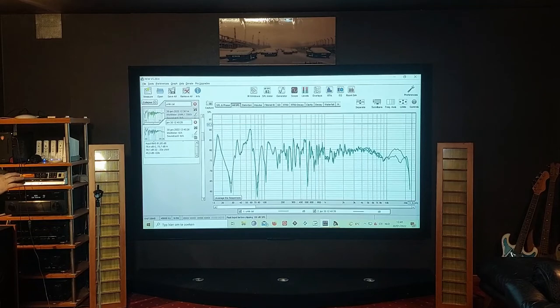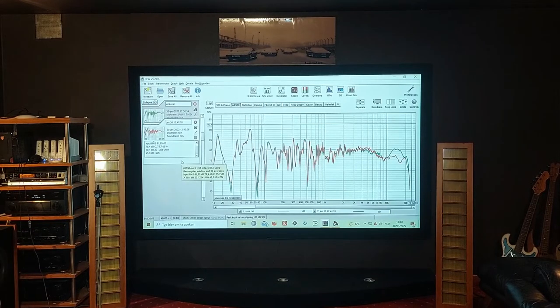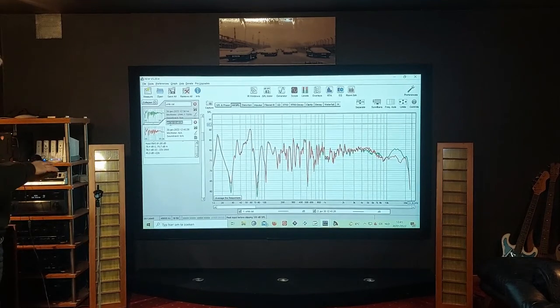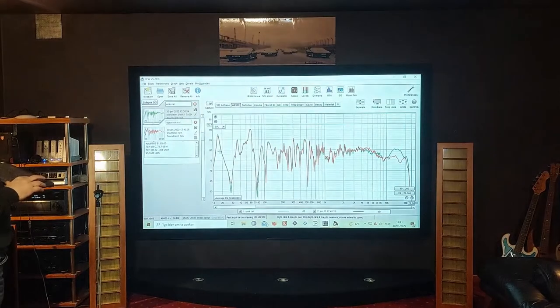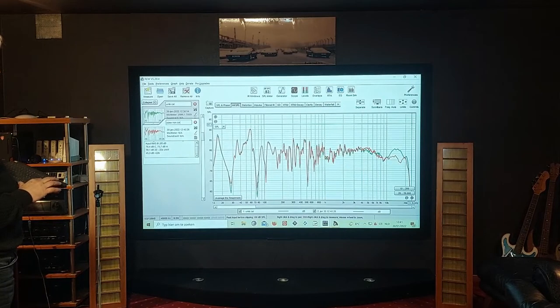I give the measurements different colors to see the difference. I name the second one 'IPAO microphone non-calibrated'. You can already see that this microphone is very, very good — from around 20 Hz up to about 3 kHz you get almost exactly the same measurement as the UMIC-1. Up in the higher frequencies things start getting different, and that's especially where we will need the calibration difference.